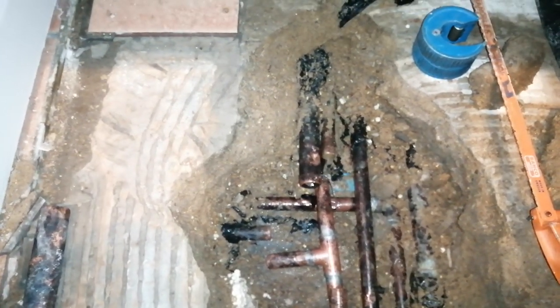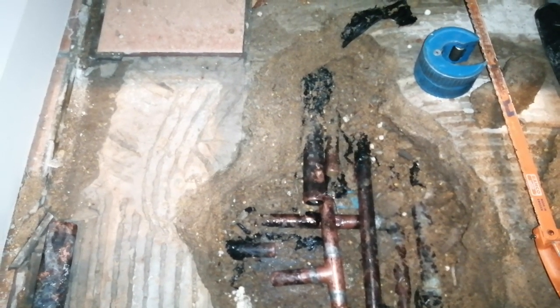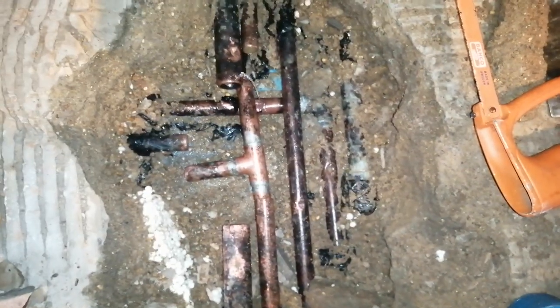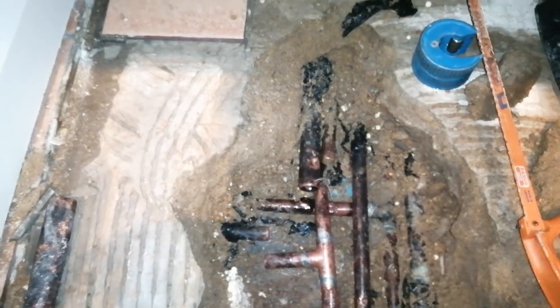It's not easy to find a leak. I started from all the way at the other end, about four tiles away, and worked my way in — there was water there, but the water was running downhill. Water finds the line of least resistance, as you may know. Bear that in mind when looking for leaks, or hopefully not creating leaks by doing pipework in a screeded floor like this. Until next time, bye bye.